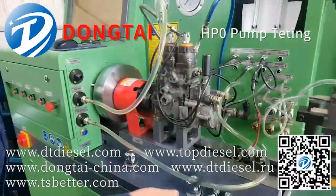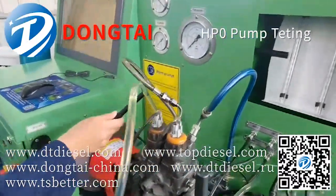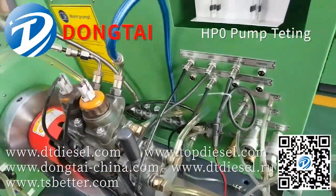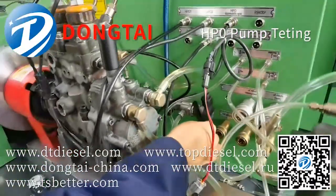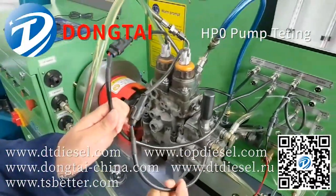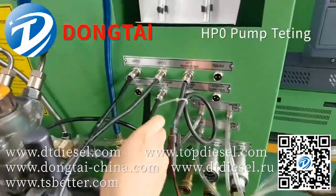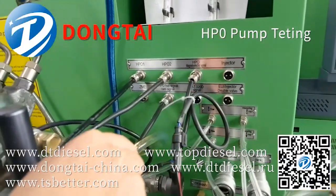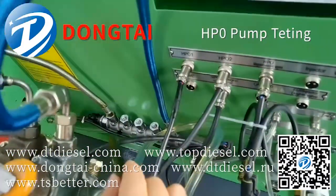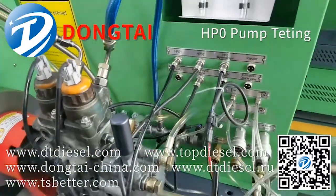This is self-priming pump pipe. This is fuel return pipe. This is two high-pressure oil pipe connected with the pump and the common rail. This is PCV1 cable and PCV2 cable. This is HP0 Hall signal cable connected with the sensor of the pump. This is for 3 pins. We also have magneto-electric signal for 2 pins.